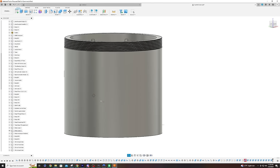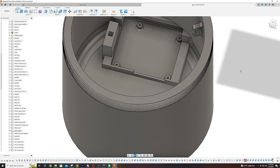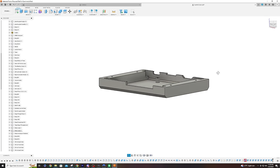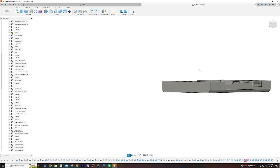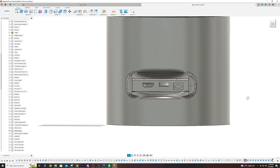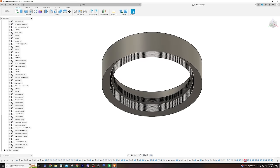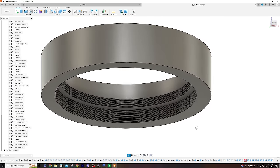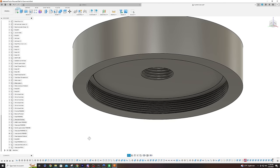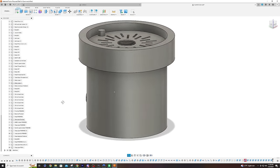The tube aspect is simple — just an open cylinder with threads added to the top, which Fusion 360 made easy. Then I made a motherboard enclosure for the Switch dock guts to sit in, merged it into the tube model — it came out a little rough in the back but I spruced it up as best I could. For the lip, I made it double-threaded: the inside top ring houses the switch game holder and screws into that, while the threads underneath screw into the tube itself, making it look like a warp pipe.